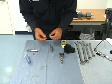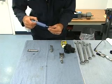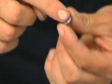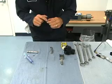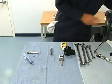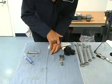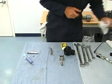Next, we have the poppet landing. Get some blue goop on both sides of this, smear it around a bit, and drop it down in the valve body. Just push it down there a little bit with my finger and make sure it's seated down in there flat.